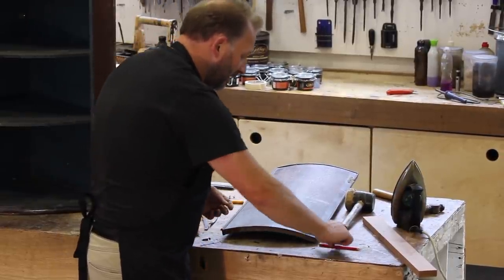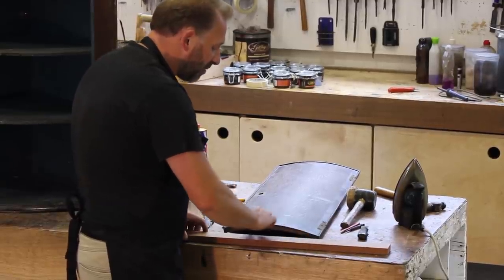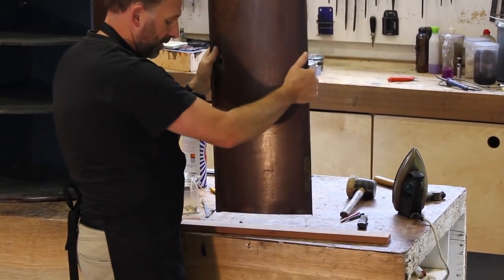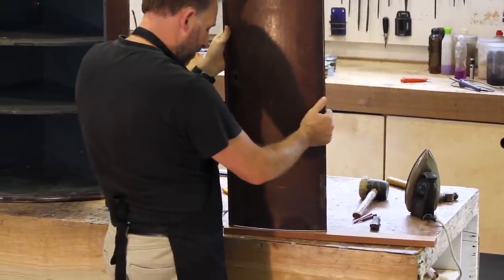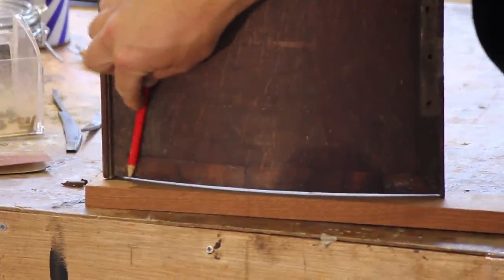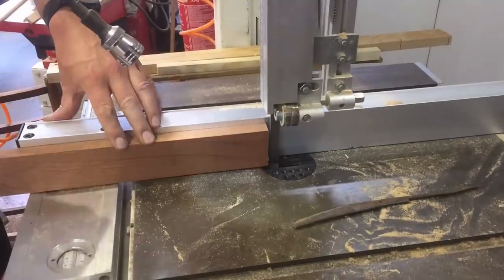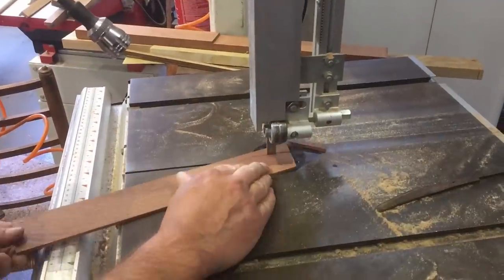There's a nice piece of mahogany because the bead is made from mahogany. I'll just roughly mark the bead to the shape of the door. I'll pick the door up, slide it into place, and mark on the mahogany with a pencil held flat down to the surface so I get the raised part of the bead correct.